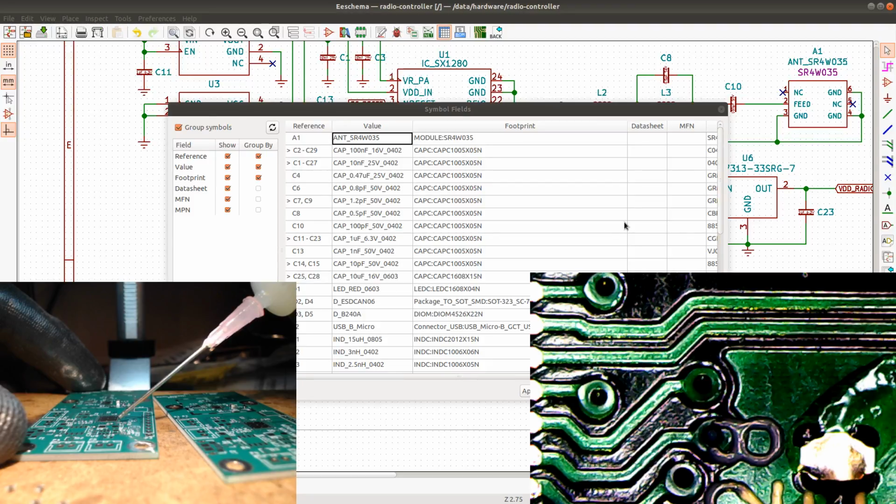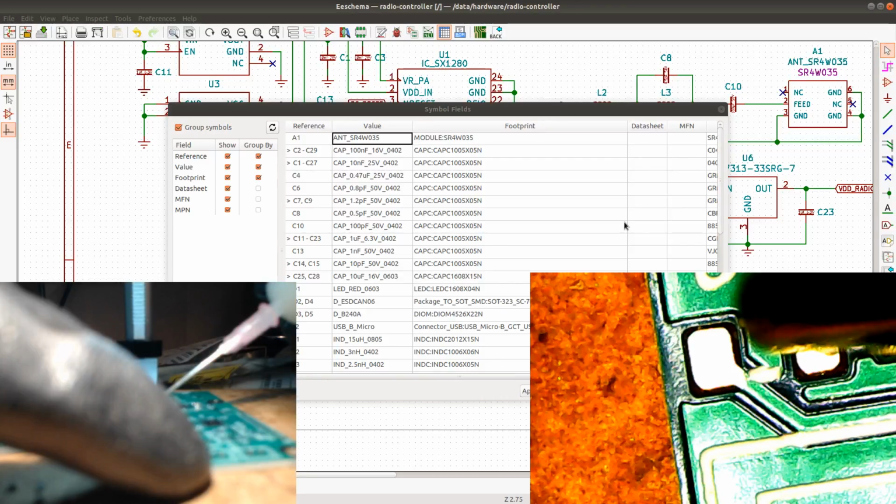So to the USB connector there. So this modem is actually an STM32 based thing, and it has a so-called LoRa modem chip on board, and it has a CAN interface, and it has a USB interface so that you can connect it to the computer. And it is a prototype for that kind of chip. I only found one single chip that sort of had enough documentation and looked like it provided very robust and high bandwidth communication, and also at a reasonable price, that I really had to try this.